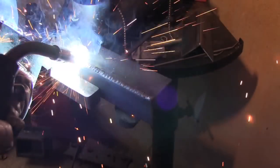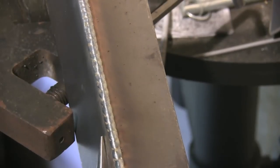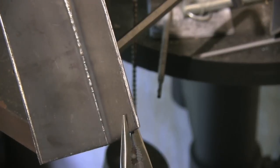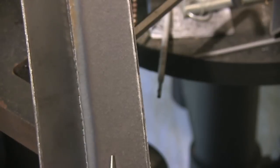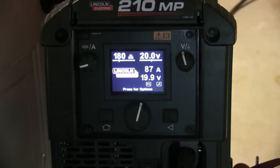I see a lot of welds posted on forums and on Instagram where the ripples are just stacked like dimes and I'm thinking that looks like a much lower wire feed speed than what I'm accustomed to. So I'm doing some experimenting here. For an outside corner on eighth inch thick metal, actually dropping the wire feed speed may not be a bad idea. Slowing that travel speed down helped with the penetration a lot. It just didn't seem right either way — the sound of that arc just didn't seem right to me.